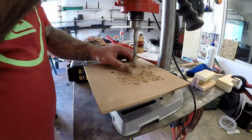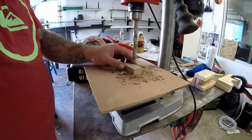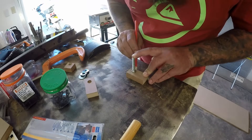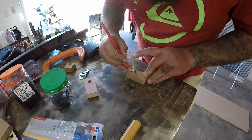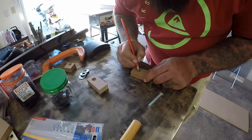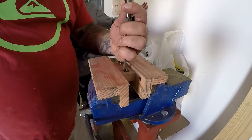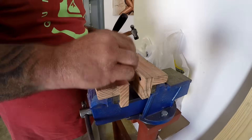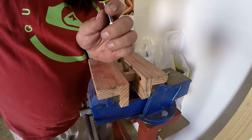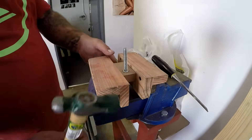On to making the knobs. For the knobs I also just used a couple of scraps of MDF and drilled a couple of holes a quarter of the way through, because I was planning to epoxy the bolts into the knobs. I traced the head of the bolt over the hole I just drilled so that I could clear that out with a chisel and get the bolt to fit in there nicely. Once everything was fitting nicely, I drew out the knobs and cut them out.